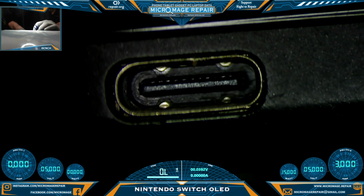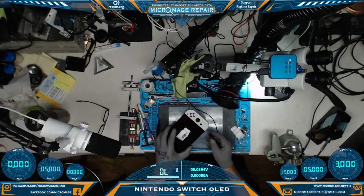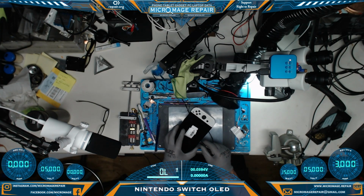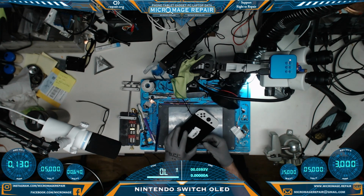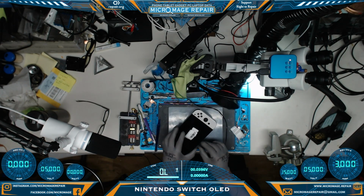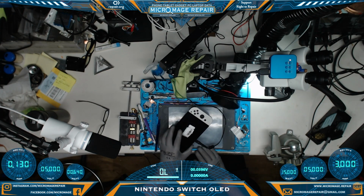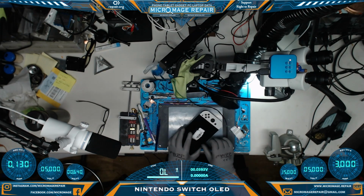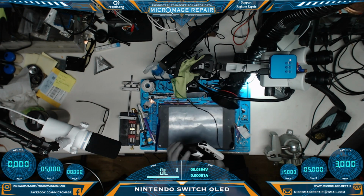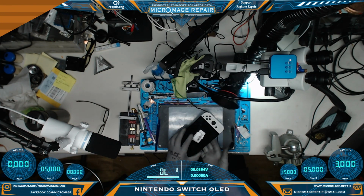Let's stick it up to the power supply and show you what it's doing. Okay, watching channel 1 on the meters. Took power to it. We're getting a 0.13 amp. So, on one side, on the other side, same deal. So, I actually had no idea what this could be. My guess, based on the Nintendo Switch, is possibly an M92T36 issue, but we'll have to open this up, do some inspecting, and see what the heck's going on.